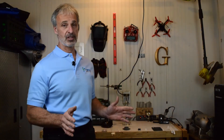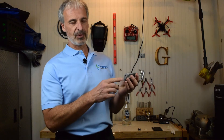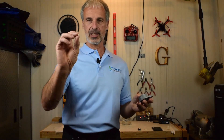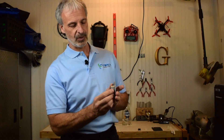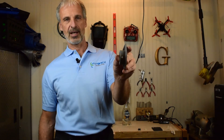The fourth technique is what we call a press-fit. For this technique, you will require some of our thicker materials, typically our three millimeter thick materials. You will have a recess or cavity in your enclosure, which is typically tapered a bit so that as the part pushes in, it makes a seal with the housing. You take the frit or disc, press it into place with a lot of force, and once it's all the way pushed in, you have a vent.